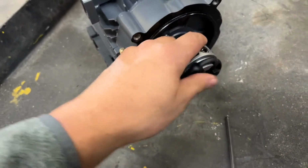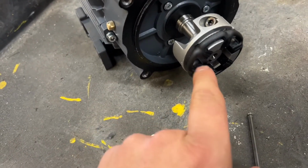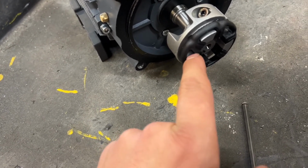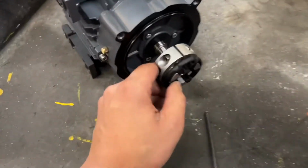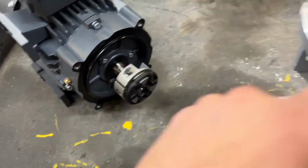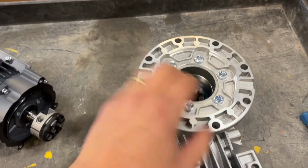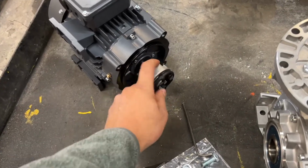And in theory, you want it as much as possible, but the coupling's about 1/2 inch thick. So I mean, you could argue that you're not going to shear off a half of that coupling. These have machine bosses on them and in here, so this accepts some misalignment, but I've never seen these wear out. I've only seen people put these together and they drive them together. There's a gap over here when they go to bolt it up, and it blows the gearbox and motor up. So that's the number one thing I've seen with these.